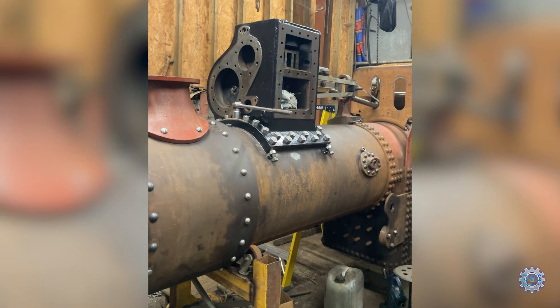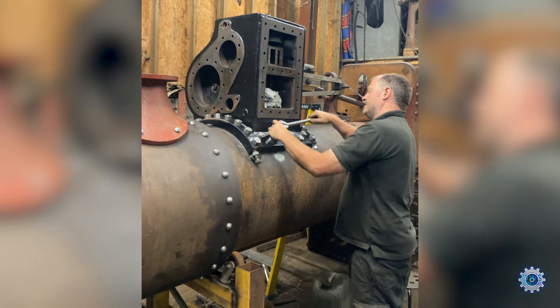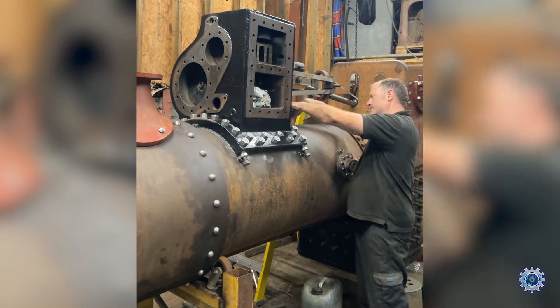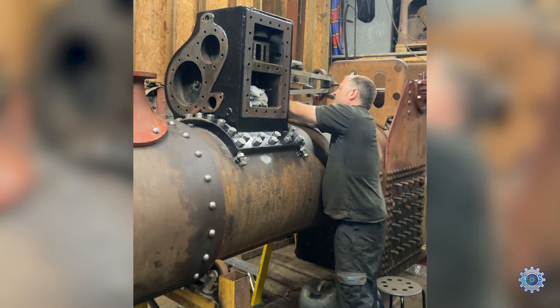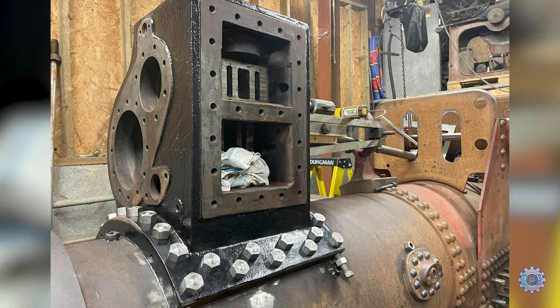As you can see it's a bit fiddly because it's such a long way in, but it did the job. Torquing them all down gradually, bringing the barrel up to the block. It's got a tapered barrel on it and the block's been machined parallel, so there was a little bit of a gap in some places, but it did meet quite well. A bit of sandblasting going on.